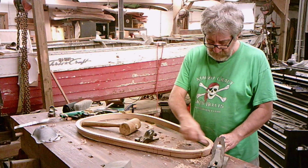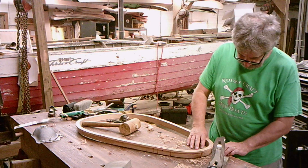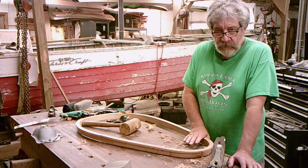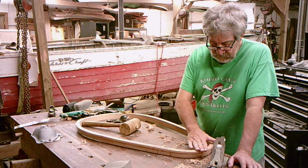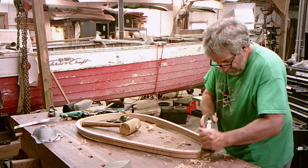I've got my combing lip finished up, all my laminations done. Regardless of how careful I am, I never can get these perfectly flat, so I have to smooth them out. I'm a big fan of hand tools — not against power tools, but I just like the way they work. They're a little slower, but they allow you to do a lot more precision work. I could come at this with a belt sander and hack it down in a third of the time, but I can also screw it up about ten times as fast. Using hand planes gives me a chance to slowly bring this down and keep it nice and level.